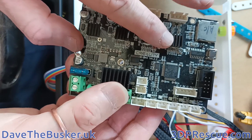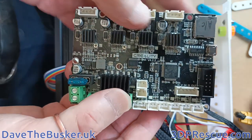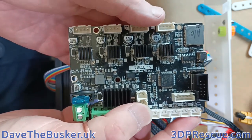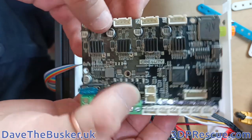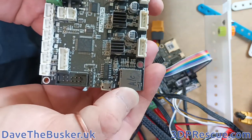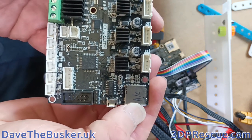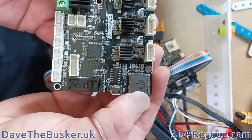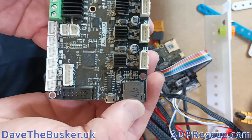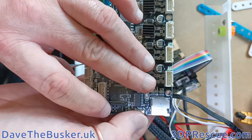The original Ender Pro board was all non-silent steppers, but then we've seen some revisions that are RCT6, which means it's got half the memory — 256k — so that's another variation of the firmware. And again, if you look at the SD card shield here, it says A/C, which Creality says is just something written on by their engineers, but all the resources we work from tell us that means two silent steppers and two non-silent steppers.